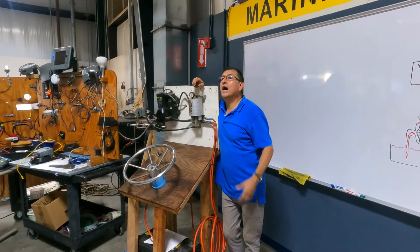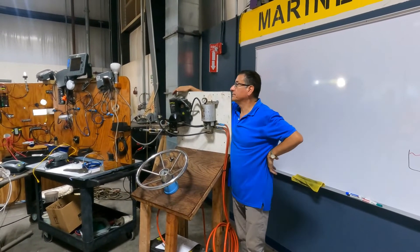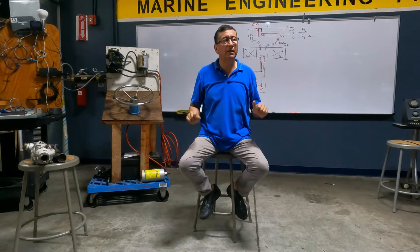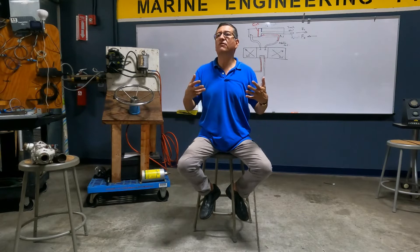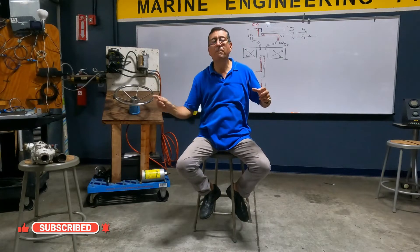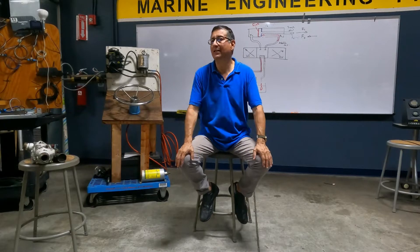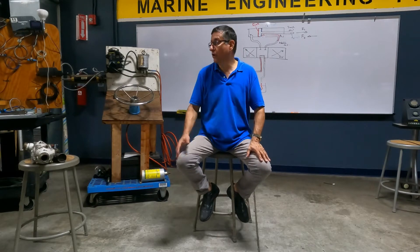When this pump starts, the pressure increases, but when it stops, the pressure decreases, and the system at rest should be 25–30 PSI. What is the problem in hydraulic circuits in terms of service and maintenance? When the fluid is working, passing through the pump and reservoir and returning, the temperature of the fluid increases dramatically. That's why you use a heat exchanger to cool it — you need to reduce the temperature of that oil.